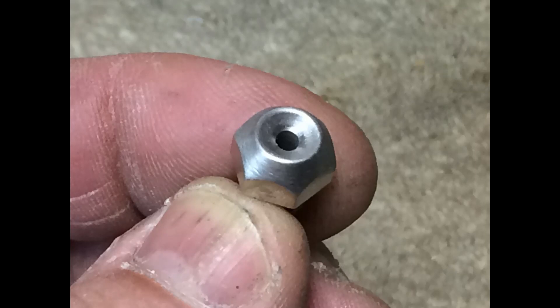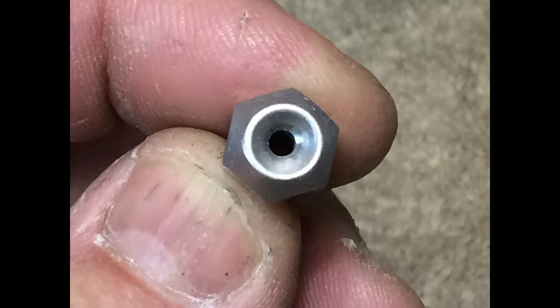Good morning folks. My name is Dan and I thought I'd do a quick little thing about rivet pulling heads for building the Zenith aircraft. They've got the modified head so it actually takes a countersunk AVEX rivet and it actually domes that when you pull it. Zenith sells the rivet heads already machined, and you can send your rivet heads back in and they'll machine them for a very low cost with a fast turnaround. Where I've got multiple rivet guns and want multiple heads set up, I've set up to make my own.